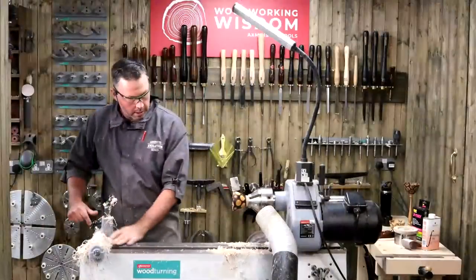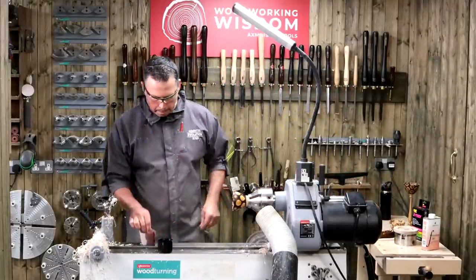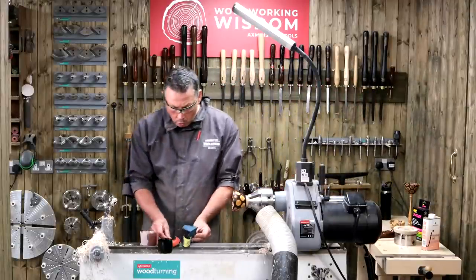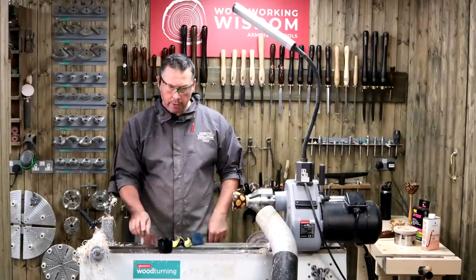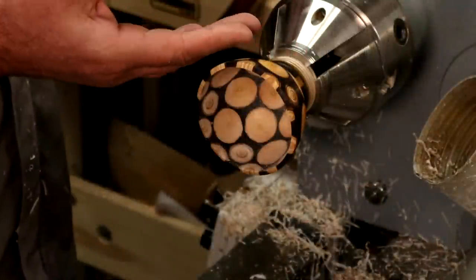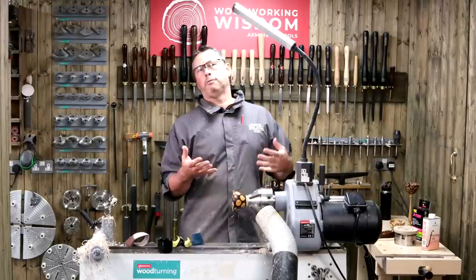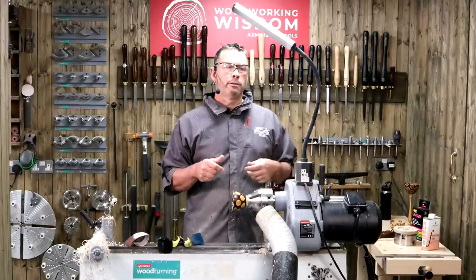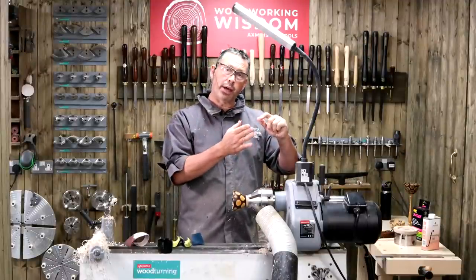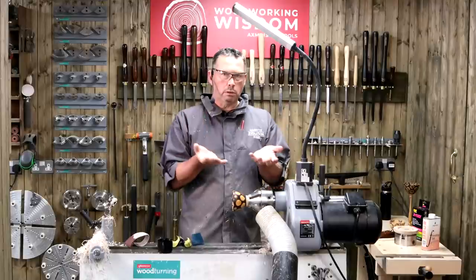Yes, Ben. So another question from Elios. Does your 6 millimeter gouge have the same profile or angle as your larger bowl gouges, or is it different? All the same, 55 degree bevel angle. What you'll find is this is quite an open curve. If you've got a very tight curve, you may want to put a secondary bevel on the heel of your gouge. No given angle, I suppose 45 degrees if you wanted one. So 55 degree main angle, 45 on the secondary, and that'll give you more of a convex curve to flow around that inner curve, and that will help minimize any ridging that you get on the inside of a bowl. That works especially on tight radiuses.